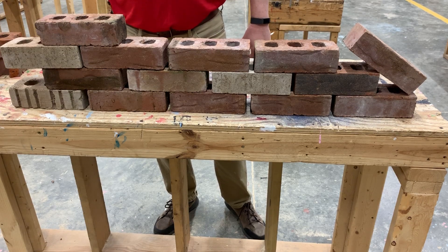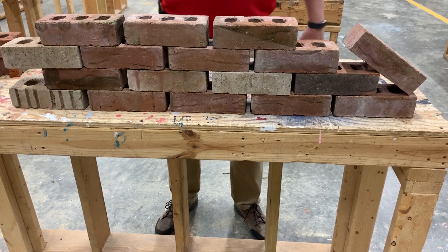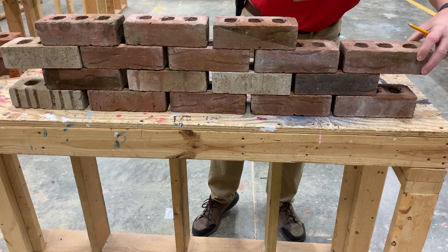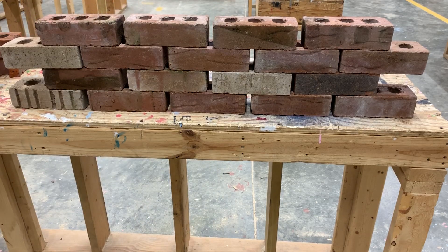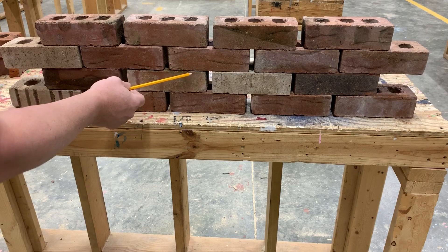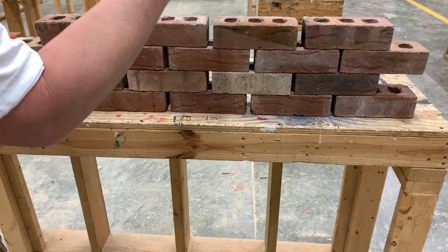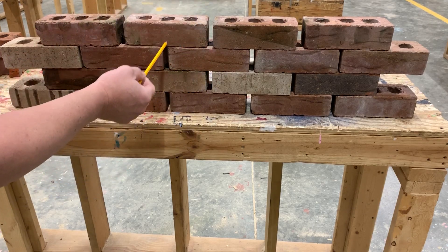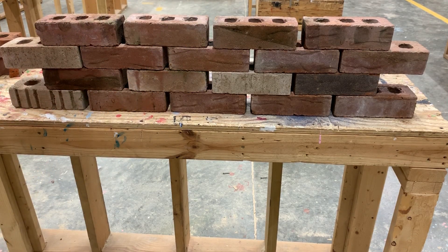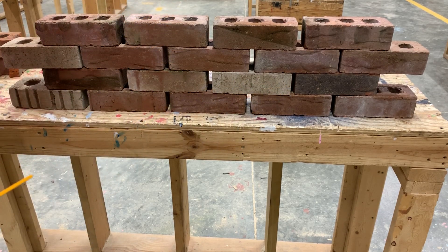All right, we're going to lay in our last course and we'll start balancing this out a little bit. You should notice a few things: first course, third course — every alternating one, they should line up. On good brickwork, you can watch these head joints go up a wall. The head joints in the second and fourth courses should line up, and they always cross at the center — the center line of this brick over the center line of the mortar joint below it. This is the running bond: four courses high, starting with five bricks on your bottom course.